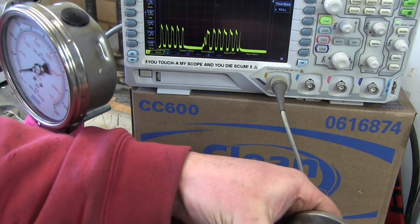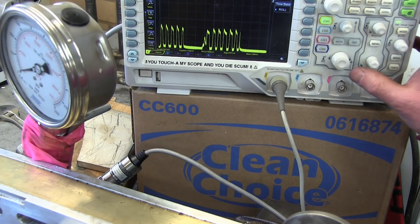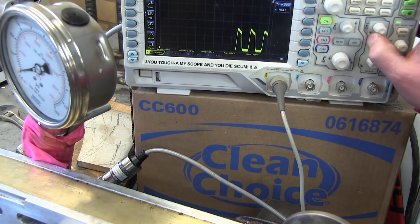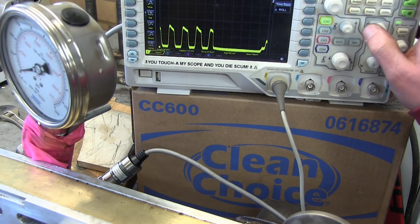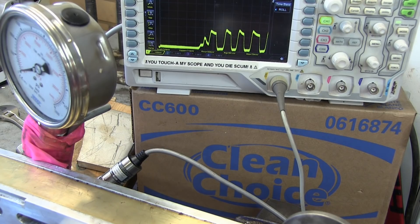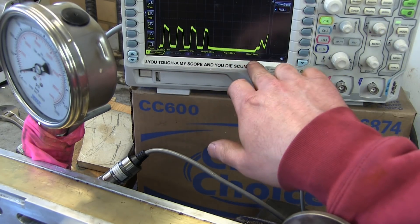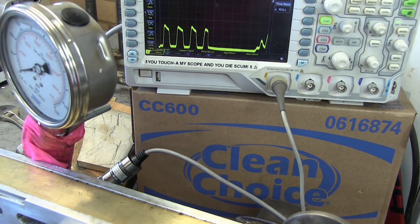We already know it yielded, and the yield is the highest point and the point we're actually looking for. 788. A Chinesium bolt is stronger — stronger than the American-made bolt. 788, and knocking that first one off, we're at 784, which is close to 135 foot-pounds. That's pretty strong. Now the L9 — bad mamma jamma, thicker head on her too.